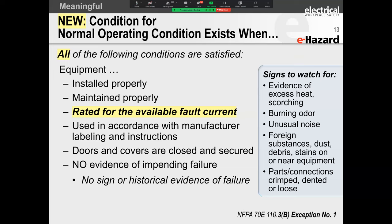We're going to remove all of our old lighting, and we're going to put in newer type of lighting that's LED based, et cetera. Okay. And they make these changes to the system. But nobody actually goes in and looks at the overall impact that those minor changes have on the macro electrical system. Now, let's say you have a panel board that's rated for 10,000 amps short circuit current, and you are feeding this off, let's say, a 30 kVA transformer.